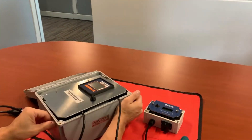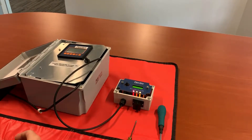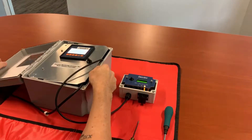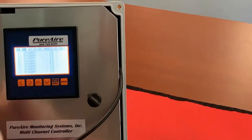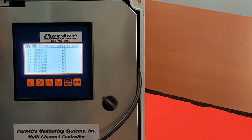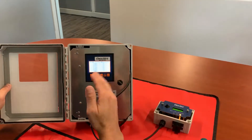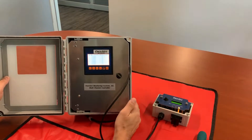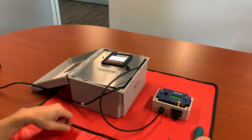Go ahead and close that back down. We'll go ahead and apply power. You want to make sure that your monitor does energize. It's going through its warm-up phase, and at the controller itself you can see they come from the factory already pre-programmed for oxygen. It says low because right now you are outputting a 2 milliamp signal, and it doesn't recognize it as being a 4 to 20 milliamp input. So it's just going to read low or fault until the monitor times out and outputs a 4 milliamp signal. Until then, we'll go ahead and wait, and then we will synchronize our monitor and our controller.